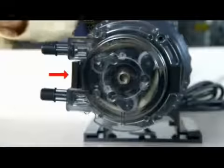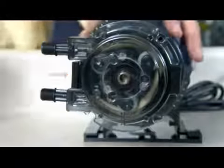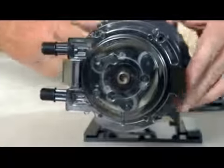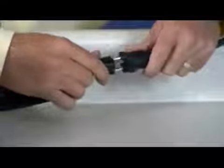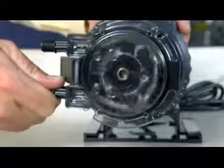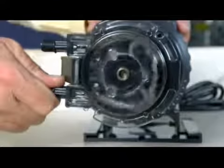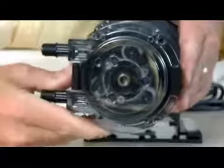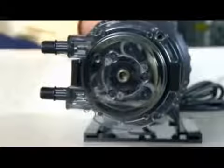Ensure the pump is off. Lift the latch located between the tube fittings, leaving the end of the latch engaged with the lip on the tube housing cover. Leave the latch on the opposite side engaged. Plug the pump in and turn it on. Turn the tube fitting on the suction side not more than 1/8 of a turn in the direction the tube must move. Do not let go of the fitting until the tube rides approximately in the center of the rollers. Turn the pump off, let go of the fitting, and secure the latch between the fittings. Turn the pump on and verify operation.